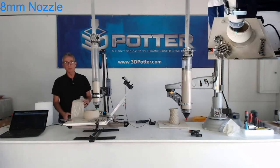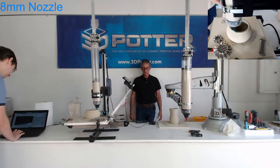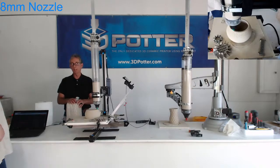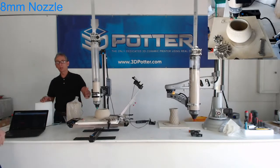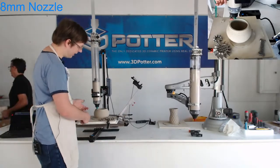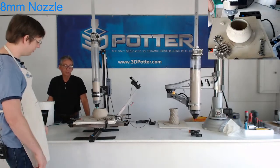Okay, what type of clay are we using? Basically, Laguna bag clay. This is B-Mix, and the number is WC401. And like Dennis was mentioning, we put about 10 to 15 ounces of water in the clay just to bring up the moisture content, which you actually need for interlayer adhesion. So if the clay is too dry, you're not going to get proper adhesion. I'm not sure if this camera can quite show it, but the mushing factor, how much one layer is pressing into another, is actually very important.